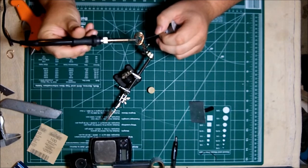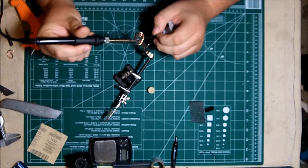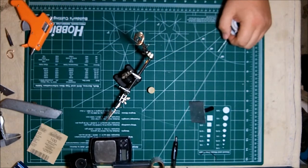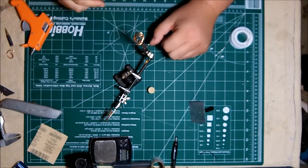If we melt the insulation on that center conductor, we won't necessarily notice it or see it, but it could cause serious problems. Especially since we're not using RG316 and we're just using the standard wire that comes in a whip, and I'm not sure what it is, but it's not nearly as rigid or nearly as strong as RG316 is.